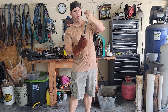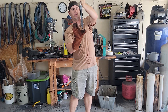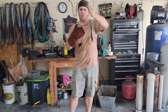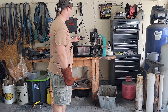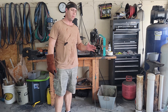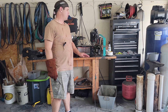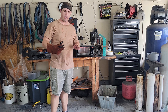Okay, all the knives have now been hardened. We are now going to temper them. I hardened them all roughly at the same spots. Now what I'm doing is putting them in my little toaster oven at about 525 degrees, and I'm going to leave them in there for probably about a good three hours to really make sure that they get good tempers on them.